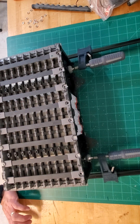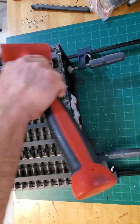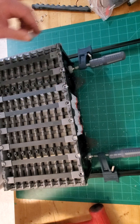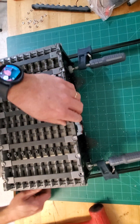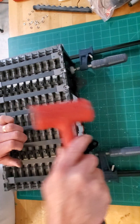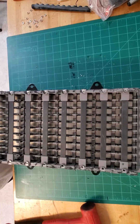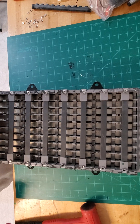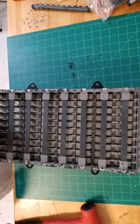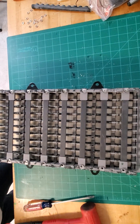Before I take the clamps all the way off, I always try and tap on the sides a little bit to make sure they're fully separated from the rivet heads, in case I have to pry some. I also forgot to mention one additional tool you might need: a small flat-tip screwdriver to lift the metal brackets if needed. Some of the rivets might still be partially protruding.